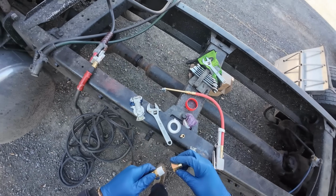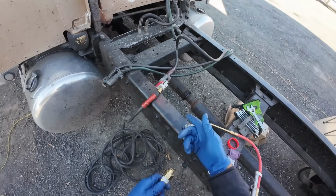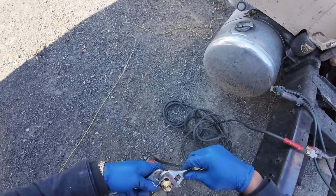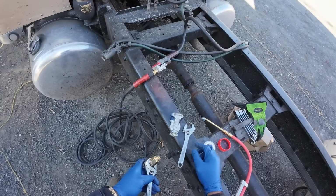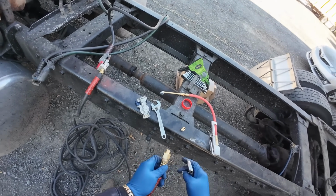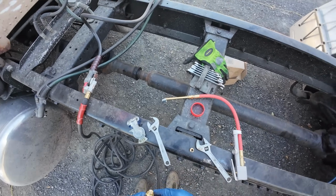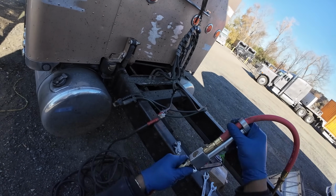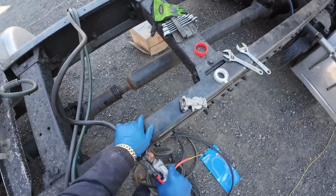And the reason why the truck is running right now, it's actually 2 reasons. One, I'm gonna need some air to air up my tire back there. And the second reason why the truck is running, whenever I'm doing an oil change, I like to let the truck run for a little just to get the oil nice and hot, you know, because it flows a lot easier when it's hot. So that's the reason why I have the truck running right now. Now I'm gonna go inside and release my trailer brake, and we should have airflow.